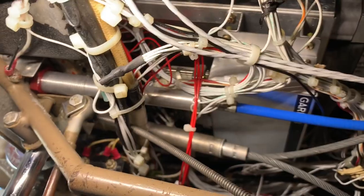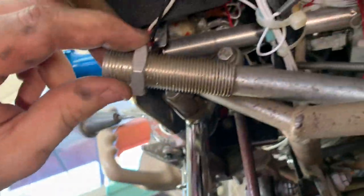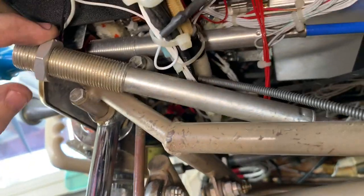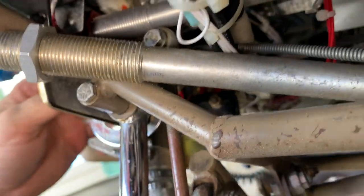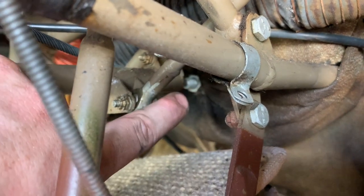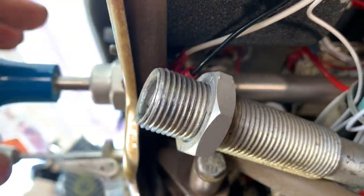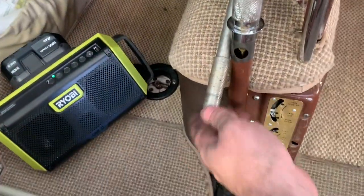Always remember to take your shoes off when you're in people's leather planes. Be grateful that the mixture cable is at the bottom of this mess right here and not behind everything, because then it would really stink. If this cable was not on the front there, you'd have to undo that nut from the other side and then just pull the whole cable out.